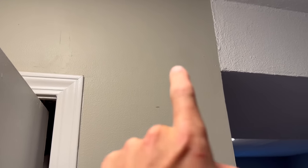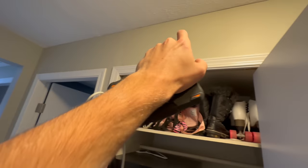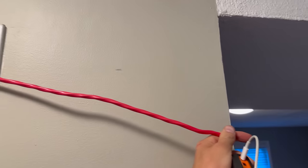Now figuring where I'm gonna put my sounder strobe, and right here is where I'm gonna have to put it, which is further down this way of the house than I wanted to, because that's a big stretch that way without anything. I was gonna put it here, but then there's a big old header that runs through here. So I've got a line marked there. The strobe has to be between two meters and 2.4 meters off the ground, or 200 to 240 centimeters, or 2000 to 2,400 millimeters, I believe. So that's marked just above the minimum height, because I don't want to go much higher. And I honestly don't know how I'm going to flush wire to it, but I'm going to figure that out as we go, I guess. And this is getting to be not much, but well, I'll try and make it work. Worst case scenario, we have to make a splice.